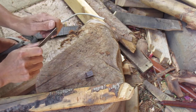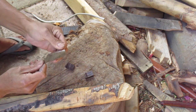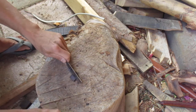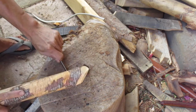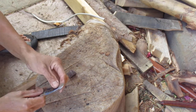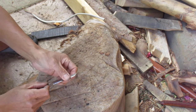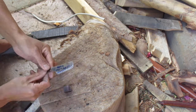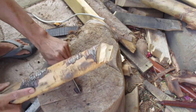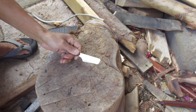Chopping at an angle is probably not ideal, but the first two times showed no damage. The wood is hard — you don't have to chop hard every time. If the edge can't handle it, it's going to fail already. That was D2 at 64 Rockwell. And this is 3V at 64 — and that thing has disintegrated.